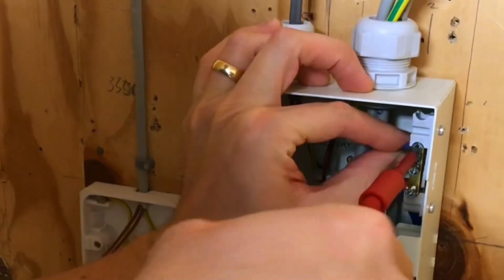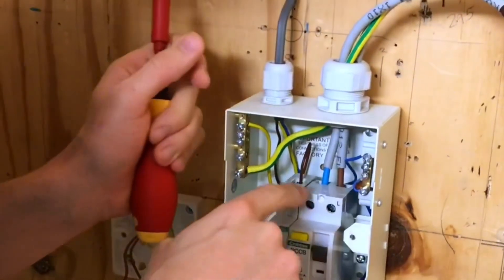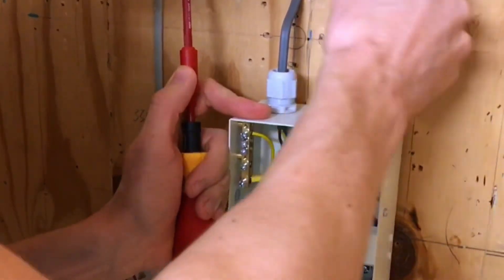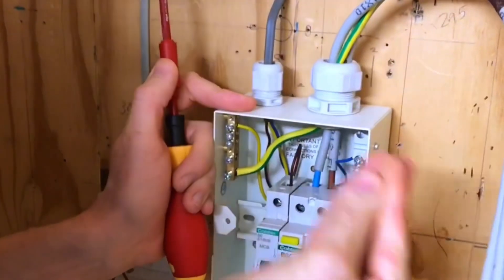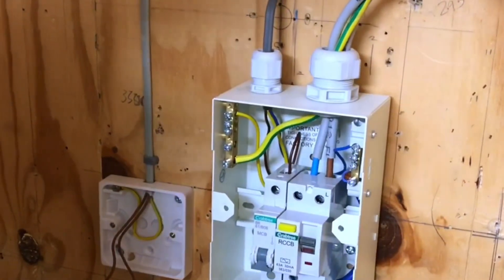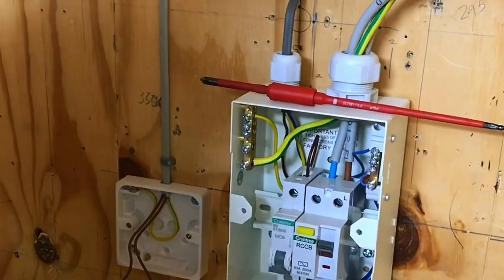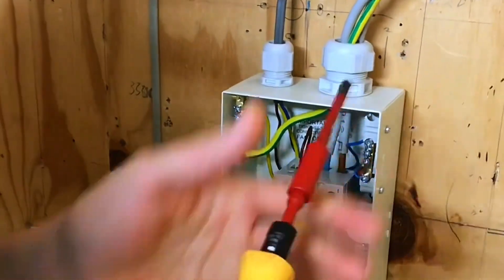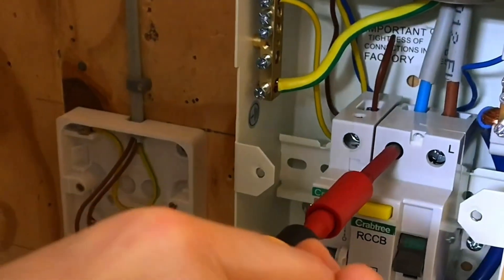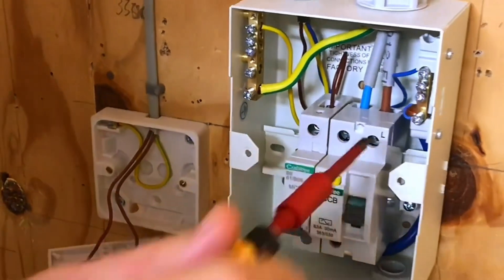Just give that the right click — there we go. Now, it might be a good idea, especially where you've got cables made up of more than one conductor, to give those a little wiggle, a little wobble so they settle down. Sometimes conductors can spread out a little bit, and we want to make sure we're not loosening the terminal. So we tweak the torque setting back to 2.3 newton meters — there we go, that's set. Now we'll make sure it's absolutely as tight as it needs to be. That's nice and tight, and that's nice and tight as well. We got a little bit further on that one just by giving those conductors a little wobble.